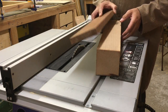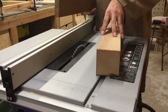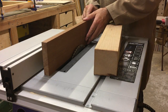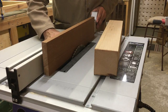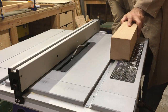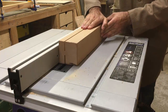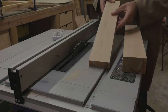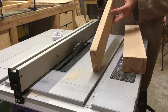I want to use this piece of mahogany and this piece of beech for this clapperboard because I think they'll give a good contrast for the chevrons. This piece is fine as it is at 20mm thick, but I want to cut some blanks out of this block of beech. I'm going to set the table saw up to a few millimeters wider than 20mm and then run the piece of beech through the thicknesser just to remove the saw kerf marks and bring it down to the 20mm of the mahogany.